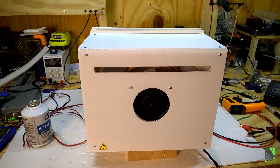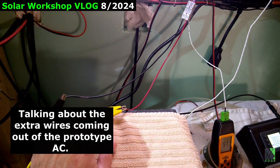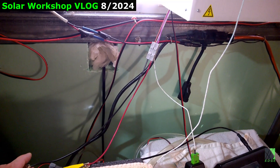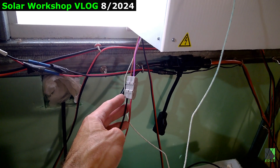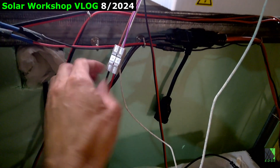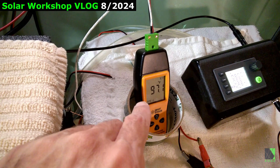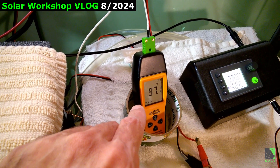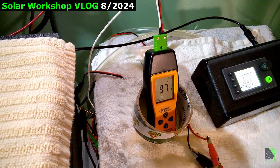Just to mention the wires: these two here power the main fans on the outside part of the air conditioner — they cool the compressor, condenser coils, and electronics, and push out quite a lot of warm air. Another set of wires controls that indoor fan right there. This thermometer is watching the temperature at the compressor because it cost a lot and I don't want to burn it out. At 97 degrees that's not really a problem.